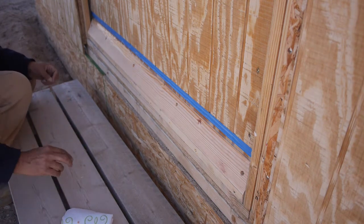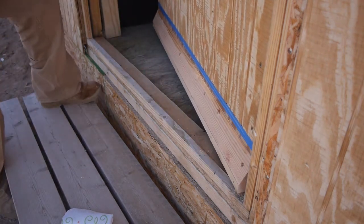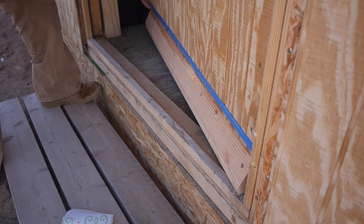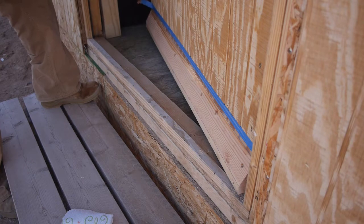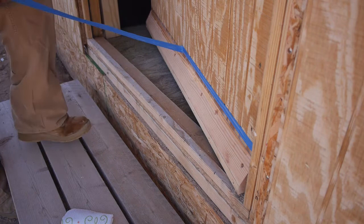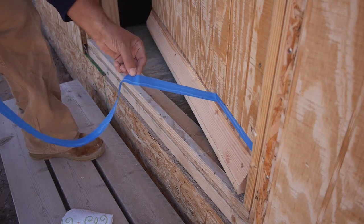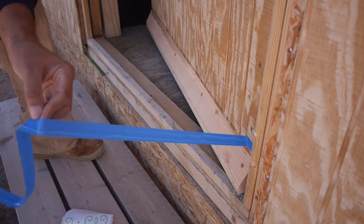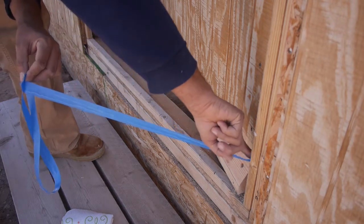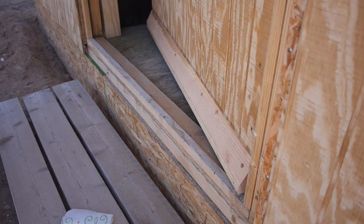I'm going to say this project is a wrap. So now we'll just pull that tape off. When we did this on the airplanes, we used 8802, Mil S 8802 sealant, 2-part. You'd mix it up, usually on a paper plate. We'd get the bulk stuff. There was also a kit that had it for a caulking gun that nobody had ever seen. So a lot of times when you ordered it, it came in the kit, and you then cut the tip off of it so you could mix it anyway. So that was kind of silly.